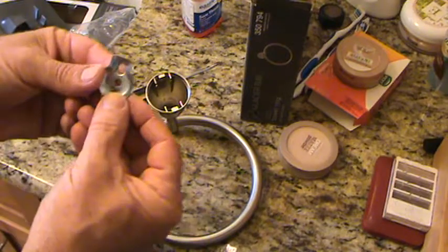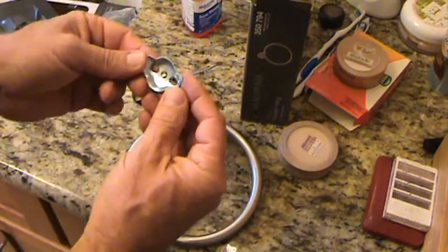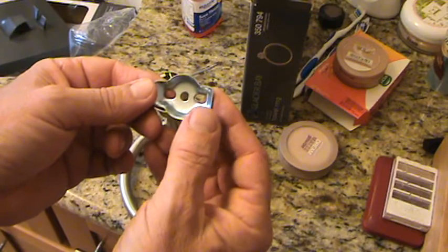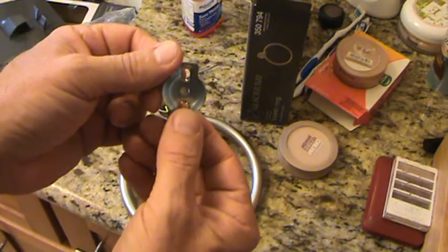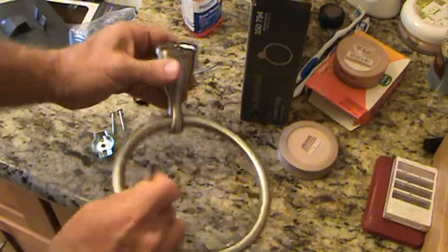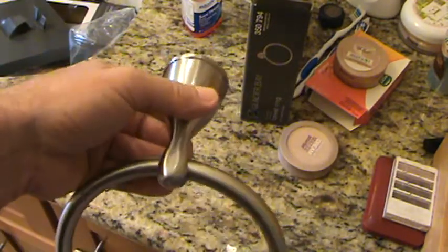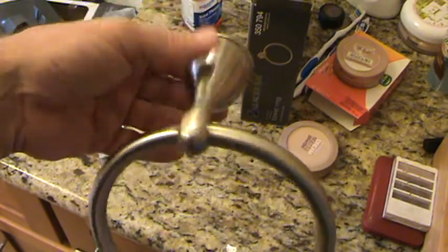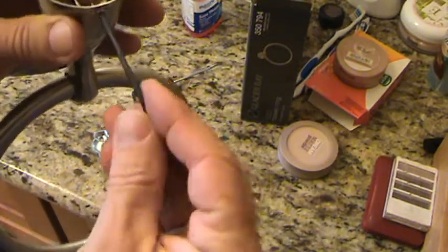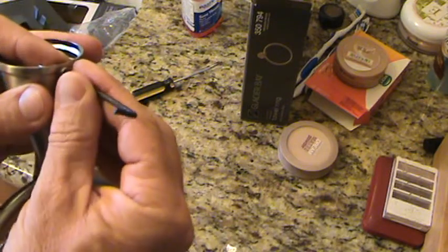It's pretty self-explanatory, but the thing I wanted you to see here is this little bracket. You want to make sure you figure out: is it going to go up and down, or sideways? I've seen some that go sideways, so look at the picture and don't assume — otherwise you get it all done and find out you installed it the wrong way. Also make sure you've got all your parts. The little set screw is on the bottom, and you always want to put it on the bottom so it's hidden. It's got an Allen wrench set screw, and this little Allen wrench came with the fixture. When you're done, don't throw it away — save it in your toolbox for next time.